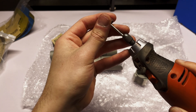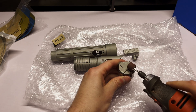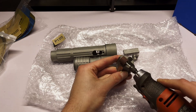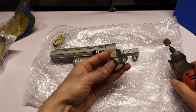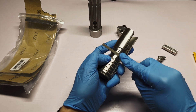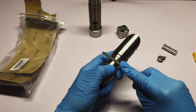Okay, so here is where the fun — or not so fun — part begins. Because of the rough surface finish of the metal parts I decided to take a Dremel and sand down all the parts until they were shiny and mirror-like. This took forever. When all the parts were Dremeled down I used some fine files to get rid of burrs on the edges of the parts as well as eliminate any deep scratches. This also took a long time, but patience is key.